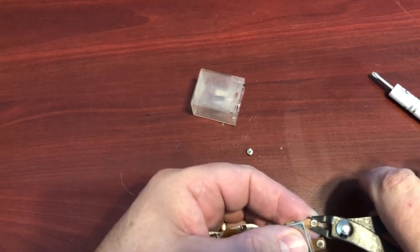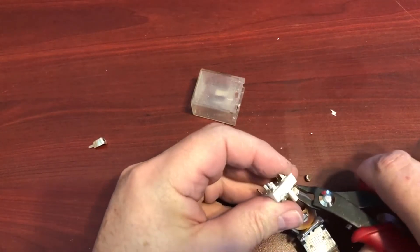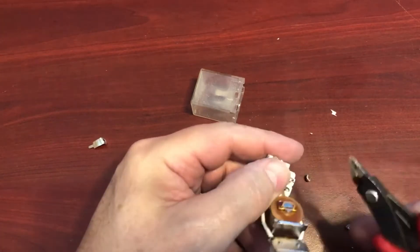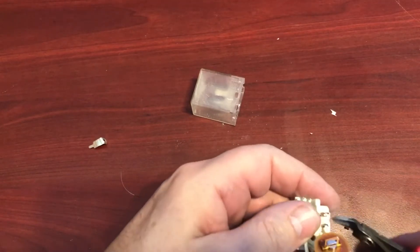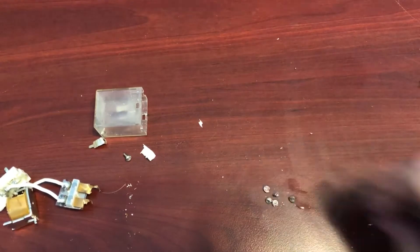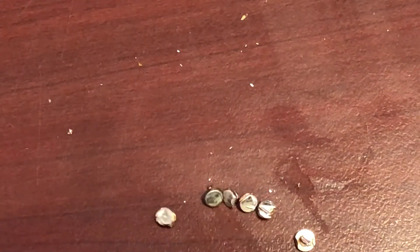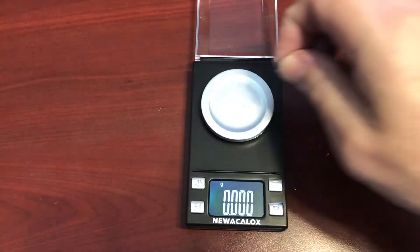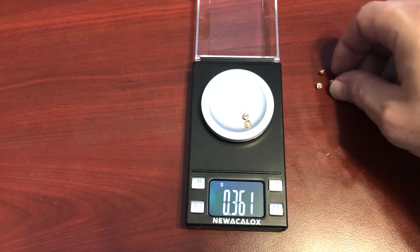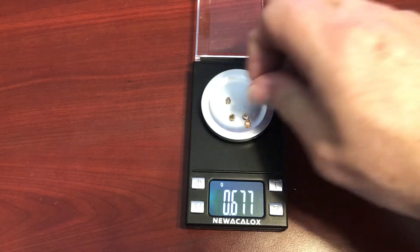So I started taking the relay apart. This relay had a screw on the bottom holding the cover on it. Once the cover was off, I used a pair of flush cutters to pry the silver contacts off the copper spring leads. I noticed there was copper color on the part of the contact wedged into the copper lead — likely copper transfer due to the tight fit and swaging of the silver contact into the spring lead. The relay is a double-pole double-throw, so there are six contacts. Once I had all of them out, I weighed them: over a gram — much more silver than the six or seven relays from the UPS board. This is like 82 cents.